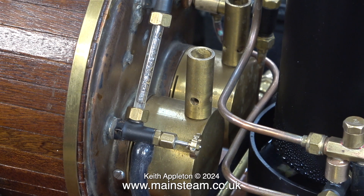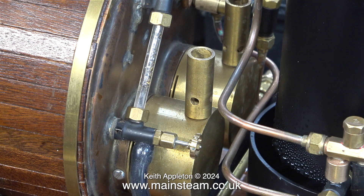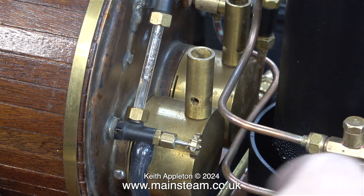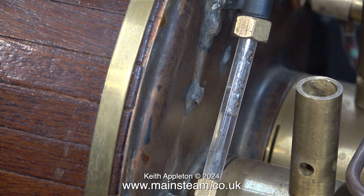The final job is to refill the boiler, but not using the hand pump — it has a very low capacity and takes ages. With all the valves on the boiler closed, after pumping some cold water into the boiler the steam has all gone and a vacuum occurs. The main thing is the boiler is filling itself with water using the vacuum inside. There was just enough water in the lower tank to fill the boiler to about half full, which will be fine for the next run.